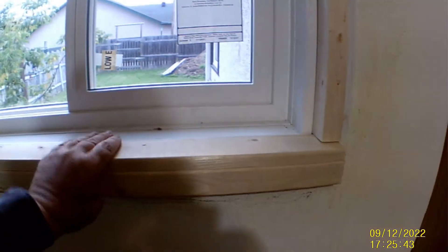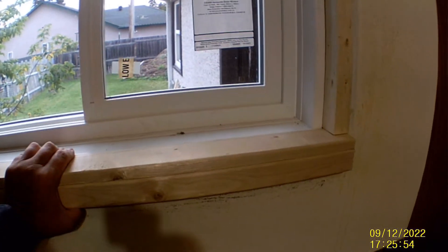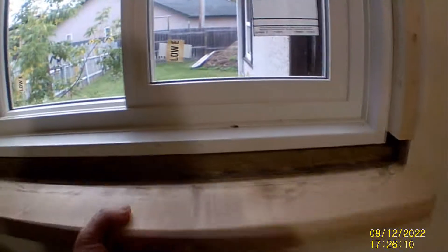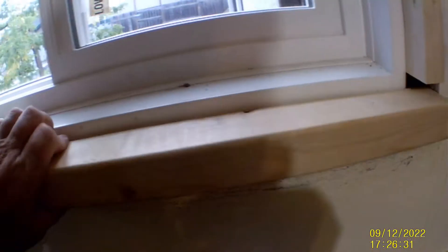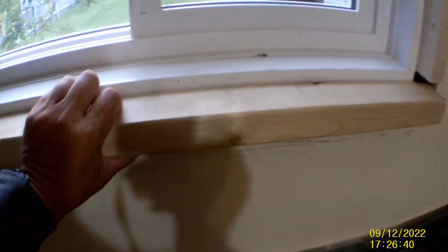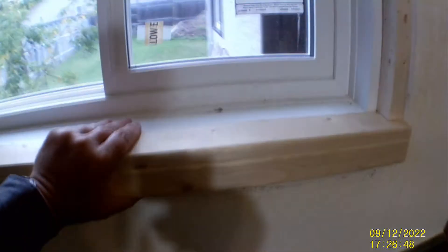I wanted to have a bit of a shelf here, and of course due to a lot of inconsistencies done on this window to start with, it's kind of a pain. I made this all out of two-by-four framing — cutting and ripping. This bottom plate I've countersunk in here because the wood wouldn't be on this edge very much and there's nothing to screw into. Screwing into the edge of wood tends to break, so I gave it a little lip so it'll slide under the window. Then I'll drill some holes on an angle and put screws in to hold it.